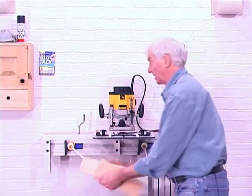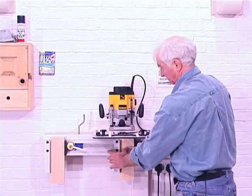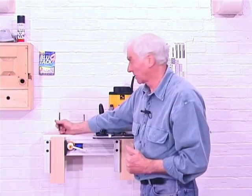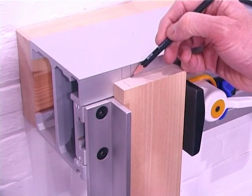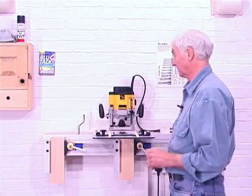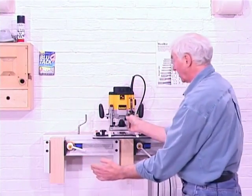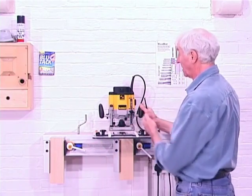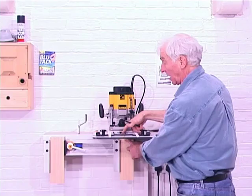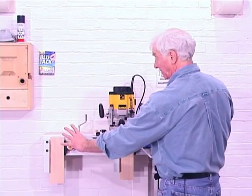Let's put the workpieces in, one on the left in front of the mark and the other in front of the cutter. Now before, we had a drawing of the cutter on the left-hand side. We don't need that. All we need to do is to mark out the top of the wood here with the joint positions. And all you need is a pencil. So, as each of these positions comes in front of the mark, so the wood is lined up on the right-hand side in front of the cutter. We have the picture of the cutter, the actual wood to be cut, and the picture of the joint that we're making, moving one in front of the other. So, away we go.